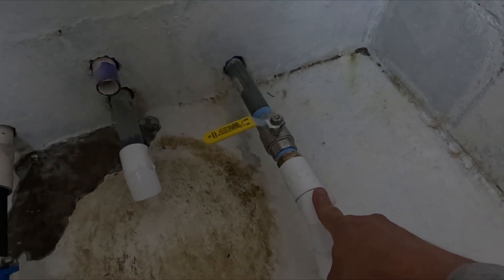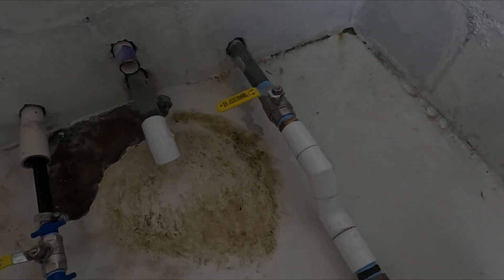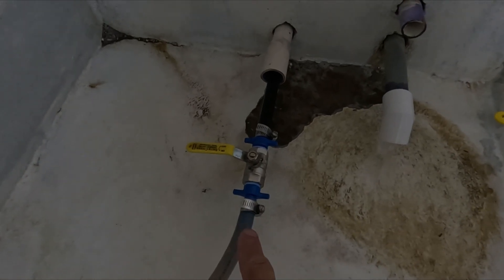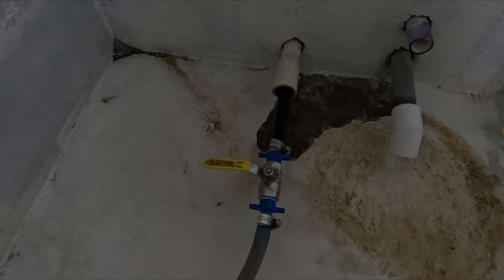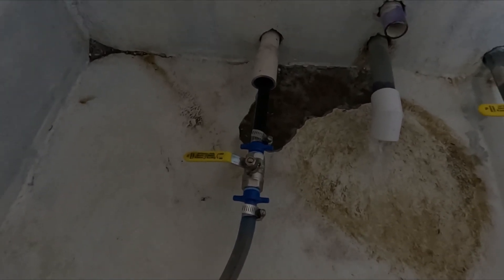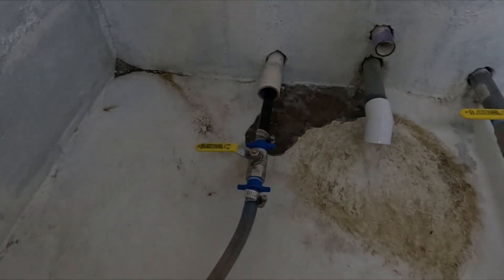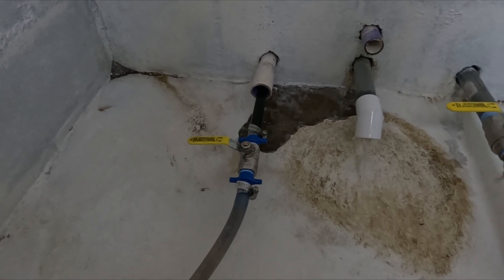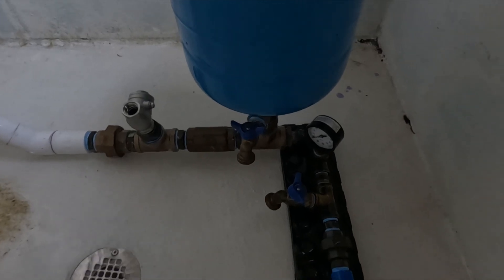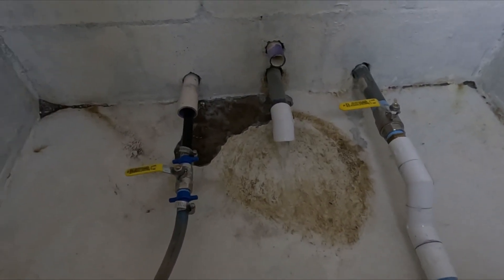This is the drive pipe. I've just shut off the drive pipe to eliminate any water flow now entering into the ram pump, and this is the delivery pipe. This delivery pipe is 600 linear feet long, buried four feet underground, and it travels up our mountain homestead property 100 feet in elevation rise to pump water into a 2,000 gallon concrete buried water cistern, which then gravity feeds our entire homestead property. This is definitely the beating heart of our off-grid capable homestead water system — it's all gravity fed once the water reaches the top of our property.